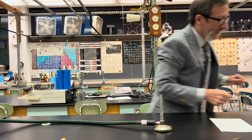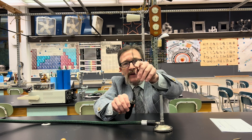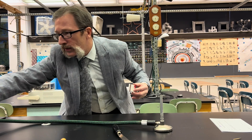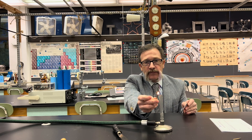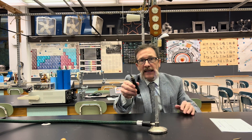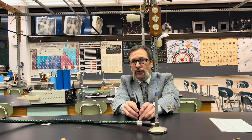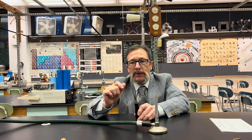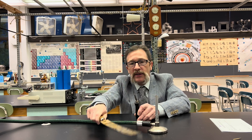So this is a matter of scale. If I take a smaller or thinner bimetallic strip — brass on one side and iron on the other, fused together and very thin — these bend with ease. If I put this under or into the flame, we should see a dramatic effect. And you can see it bend and curl very, very quickly. As it cools, it will straighten back out. This metal is just too thick; it's too hard to bend, and we end up with the popping problem.